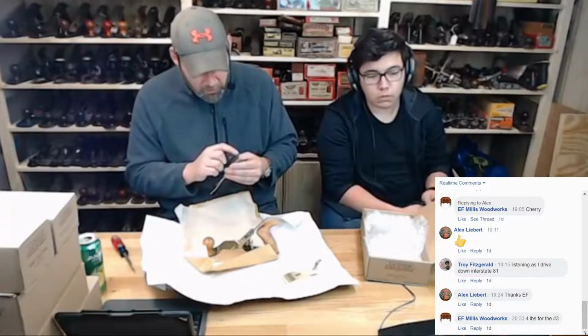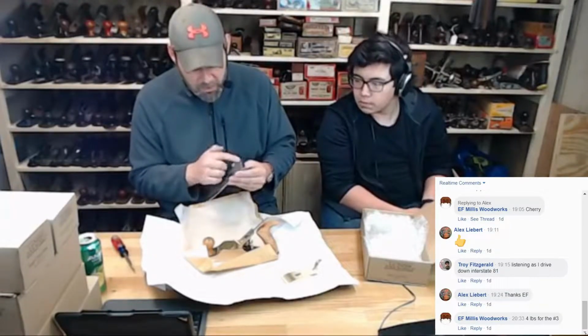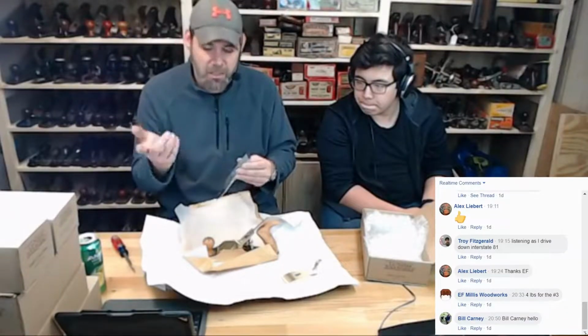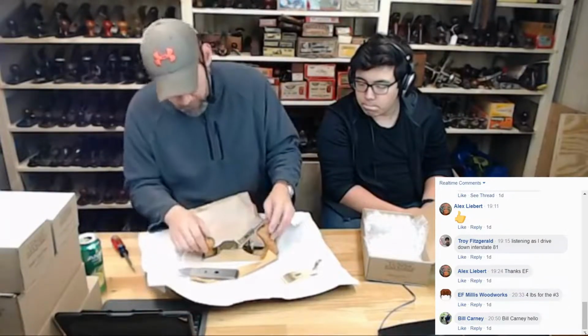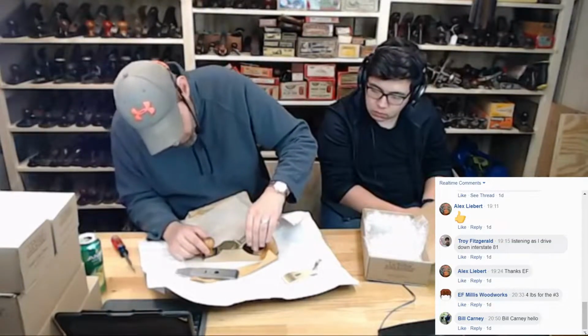The grind is from side to side on the chip breaker, and that's probably one of the things that I'll be addressing. I don't really like that. I feel like that's a place for a fine shaving to snag on. But again, I'm kind of picky when it comes to my chip breakers. Machine work is really, really well done.